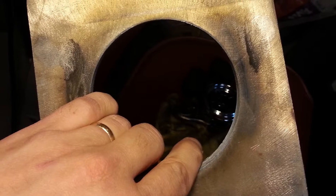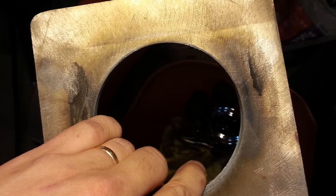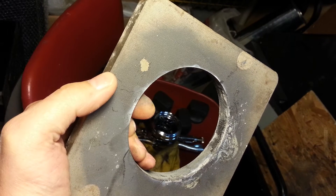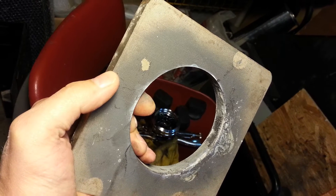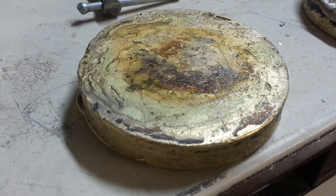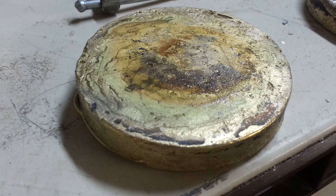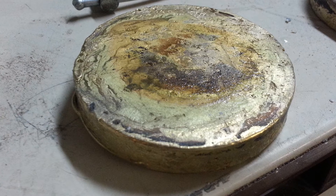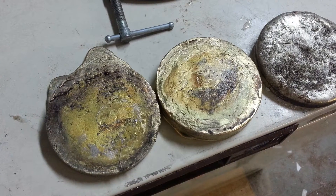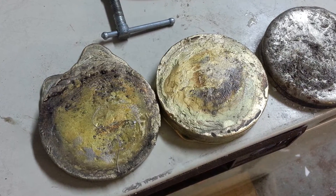My mold was a piece of scrapyard stainless — a steel square with a 3-inch hole cut through the middle, about a half-inch thick. This was clamped down to a piece of mild steel, and the whole assembly was covered in soot. The raw castings look pretty rough on the outside, but like my mother always said about me, they were beautiful on the inside. Just in case mother was lying to protect my fragile hopes and dreams, I made three so I could pick the best and cull out the weak.